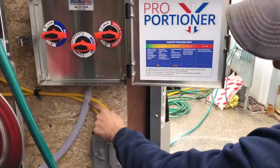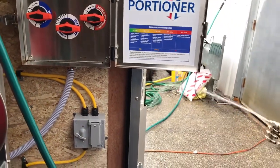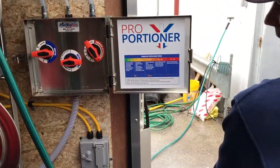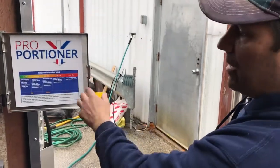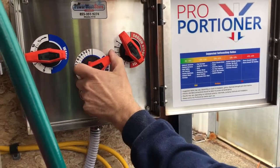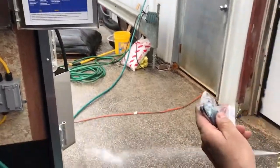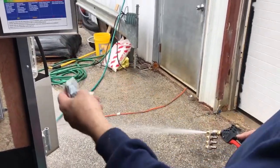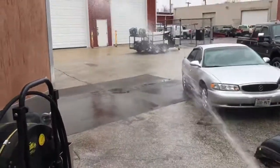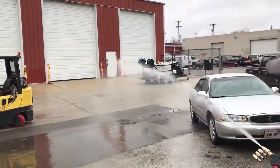You can see down here, now we're really starving the pump — we're barely getting enough through because we only have the one valve open. So I'm going to go through here and just force all the air out of the system by force feeding the booster pump. Now I'm going to take this, open my water all the way, set my SH — let's say I'm going to be cleaning some heavy growth, I might set it at four and a half percent. So I'm going to set it at four and a half percent, set my detergent at about a three or a four, and I'm ready to start using the proportioner. Right now you can see with the pressure I'm getting, I'm force feeding directly through the garden hose feeding directly into the booster pump.